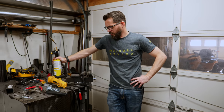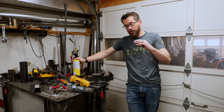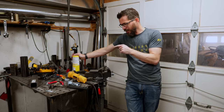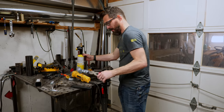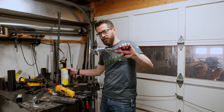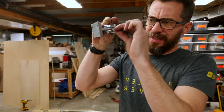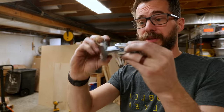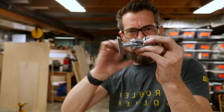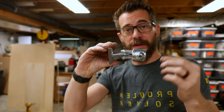I don't have a big enough vise to really clamp it down. I think I would have to get it a lot hotter to actually get it bendable and squish it down. So I just have to come up with something else. I really like that fitting and I think it could be used for a lot of things, but there's just definitely too much gap in there to be useful in this particular situation. I was trying to figure out how to get washers inside here to fill the gap. Anthony said that we should probably just get rid of this pin completely. So I'm going to take this to the grinder, get rid of this round over, pull the pin out, fit in washers and make it nice and tight, then put in a new bolt and nut and see if that will get rid of the slop enough to make this thing work.